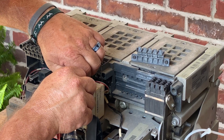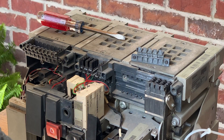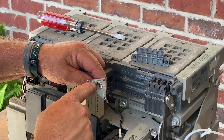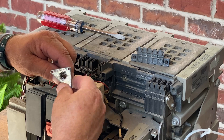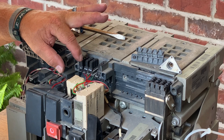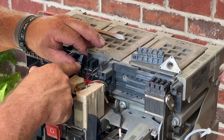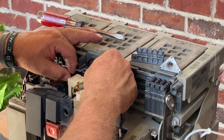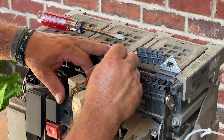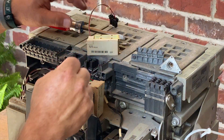So this right here is something else we want to show you. This guy also — you can see right here — the code is also going to be found here. The same code is on this block here. We'll touch on that code in just a second to give you some more clarity on it. Now we're going to start with our under voltage coil. We're going to pull the under voltage — this is the tray, the wire connection for the under voltage. You'll notice there's a little code there again. Once you learn that little code, it really will simplify life for you. This is going to be your under voltage coil.